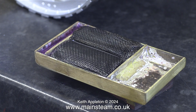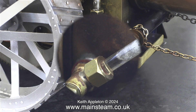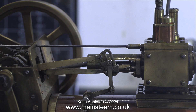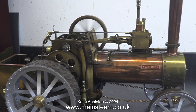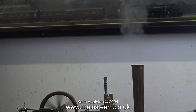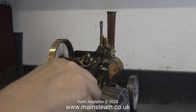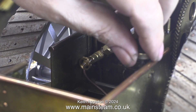The fire only seems to last for about 10 minutes or less. To raise steam previously I refilled the burners four times. With this arrangement I refilled the burner three times before the steam appeared. I did however blow down the water gauge to lower the level of water in the boiler and very soon — let there be steam.